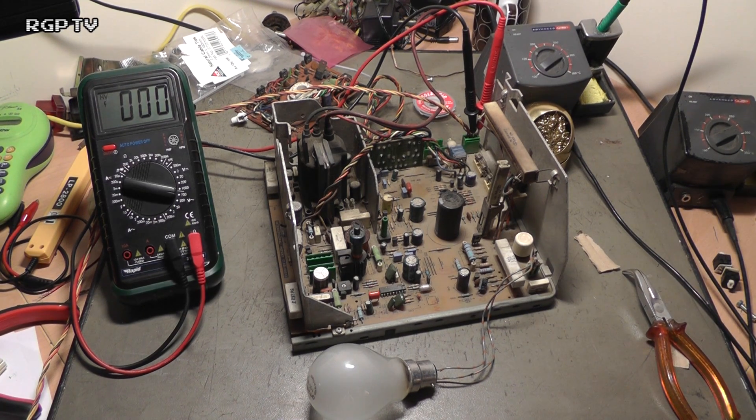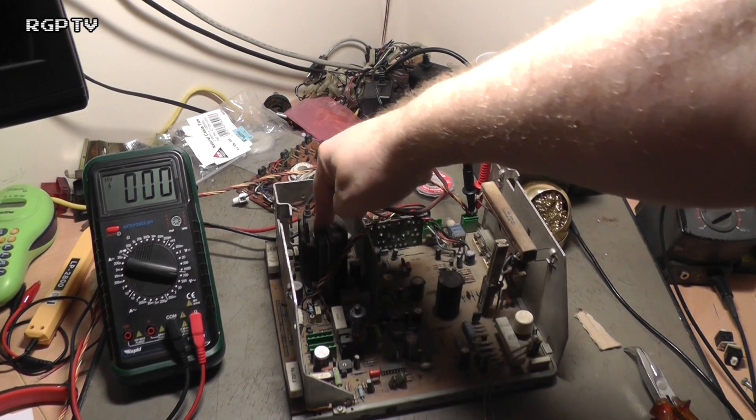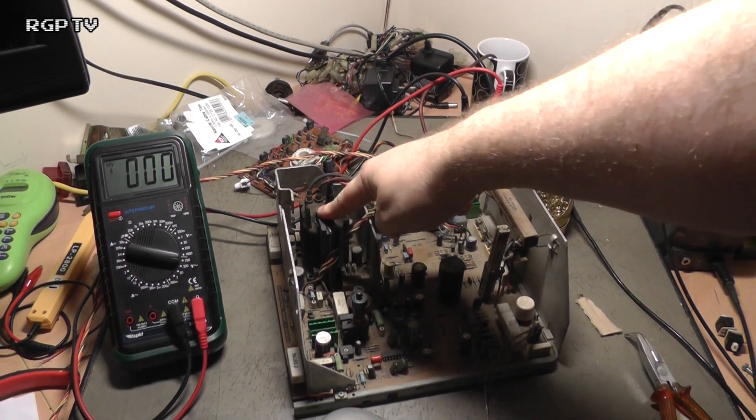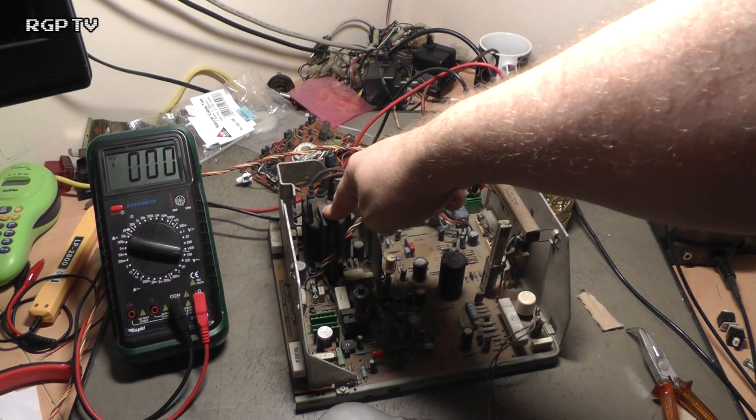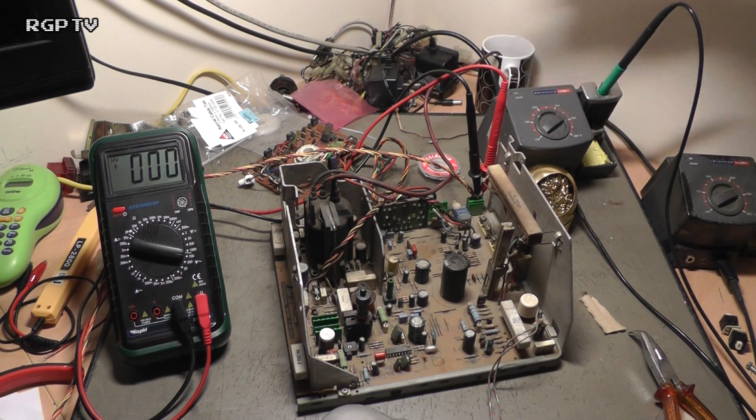I have taken those off so I absolutely do not get the rest of the chassis starting up. Specifically, I don't want the flyback to start up — that's this bit over here. For those of you who haven't looked at monitor chassis before, coming out of there for one of these is around about 20,000 volts.